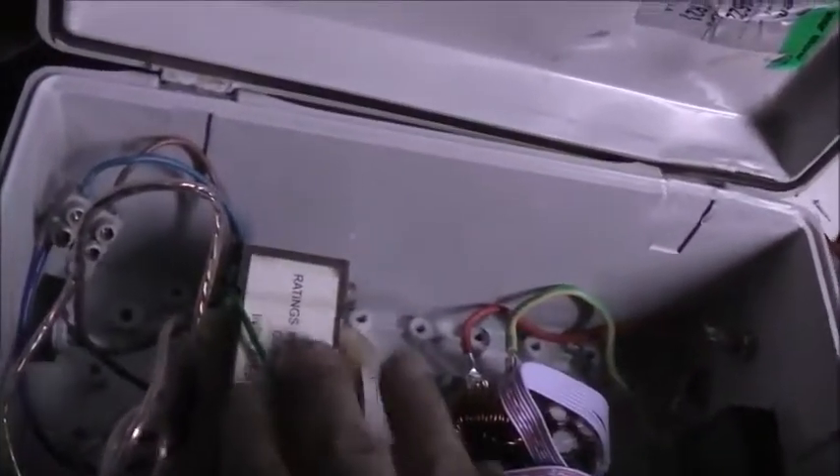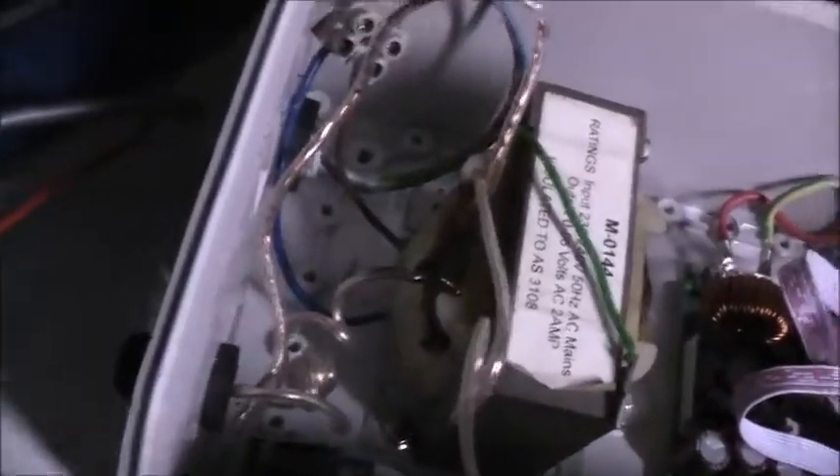Two amps is its nominal rating. I just expected too much from this little tranny. Pulling 10 amps for more than 5 minutes — no, no. Too small, this tranny couldn't do it, so the secondary decided to cook.